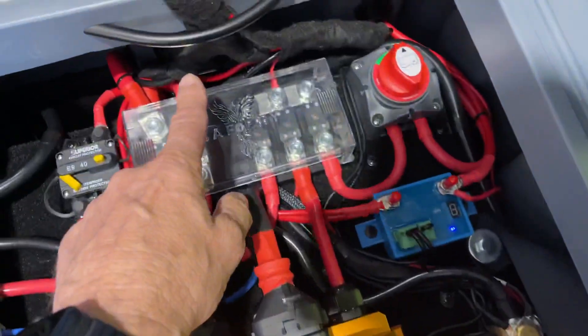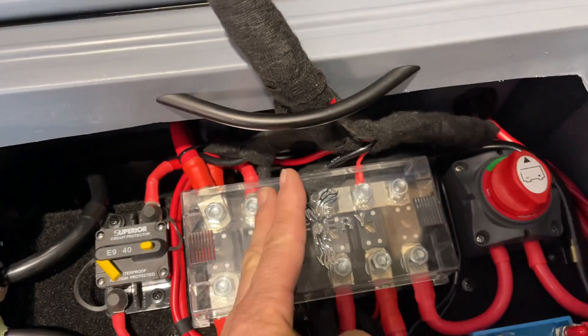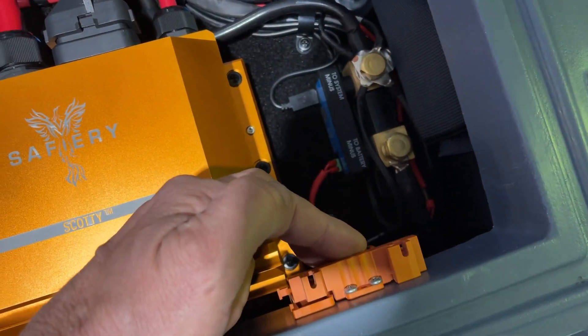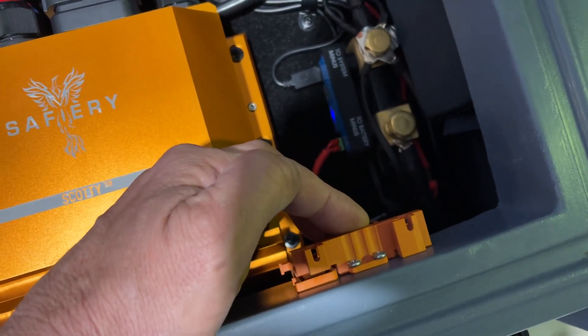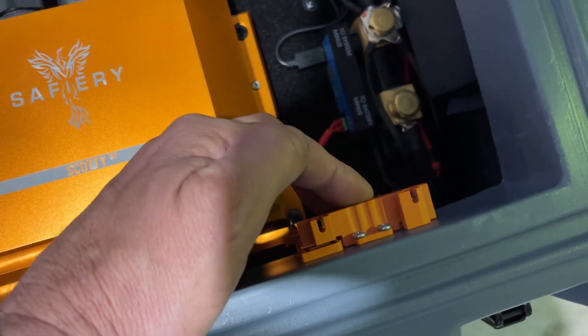This little WAGO block here is for the temperature control of the fans. The fans are at the back — you can hear them running. We have dual fans at that end sucking out and fans pushing in at this end. We've got dual chips in here which are an automatic temperature switch built into a chip capable of up to 3 amps. It closes within the FET device at temperature, set at 40 degrees C, to turn the fans on and off.